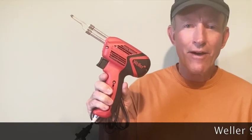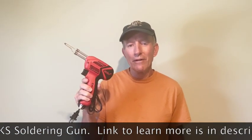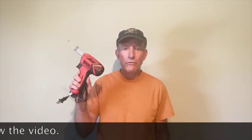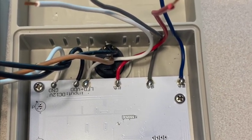There are four soldering joints needed to hook up the controller circuit board to the wires going out to the pool light. For that I use this Weller 9400 PKS soldering gun — it's 140 watts and Weller says it heats up in about six seconds, which I can confirm. You need that to get a good joint without heating up the circuit board so much that you damage other components on the front side. I recommend getting one of these if you don't already have one. I now have my common and red, green, blue wires soldered in place, ready to be wire nutted to the lead going out to the pool light.